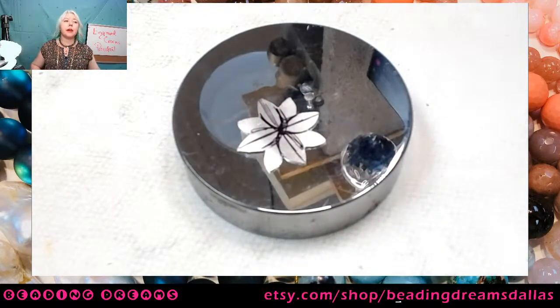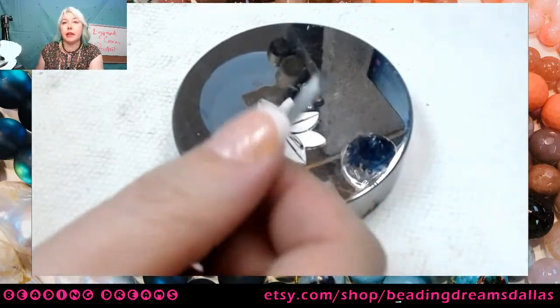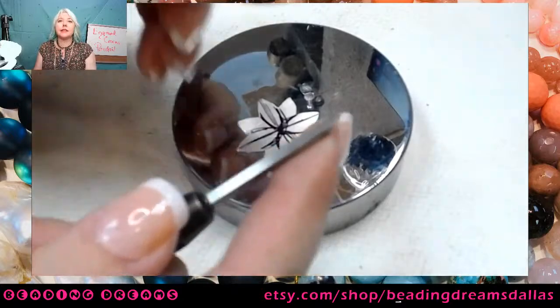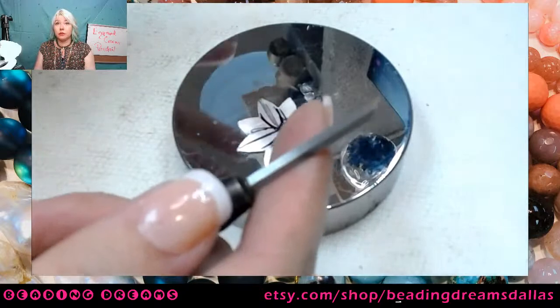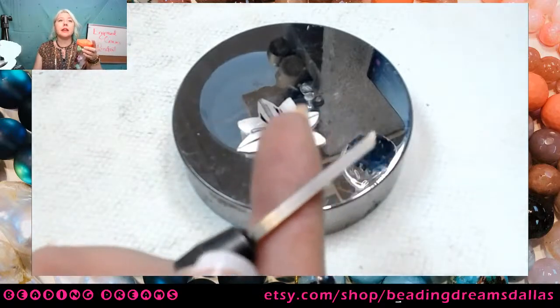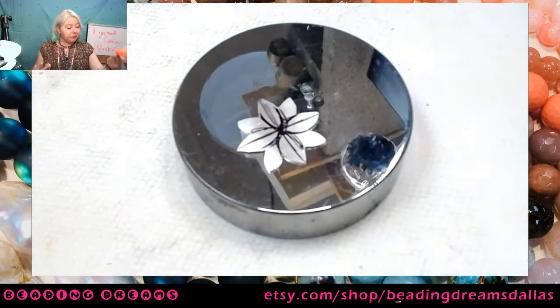Okay, so now this is where we're going to take our graver. So once again, a graver is a piece of rectangle stock that's been ground down, and then it's got a sharp point there. So what it does is it literally peels up the metal to make a groove. And people who are way more advanced at engraving than I, of course, can hand engrave all kinds of cool things. I'm still a beginner engraver, so I'm sticking to lines. Okay, lines are where I'm at.